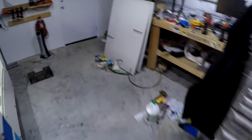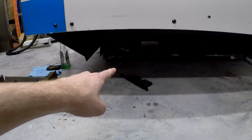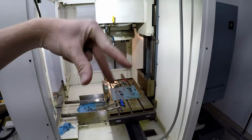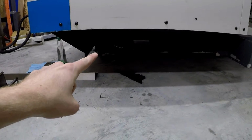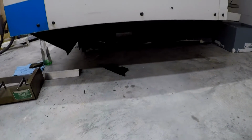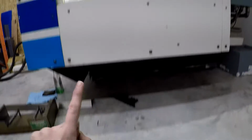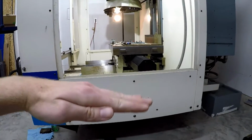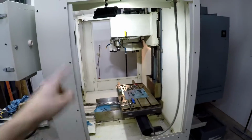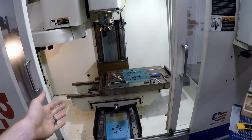Oh, one pro tip. I don't know if my wrench is still down here. When you're adjusting these guys, I found out if I loosen up one, because, you know, going back to engineering and planes, lines, and points, you only need 3 points to create a plane. So I would loosen one of these guys up and it would suddenly just start coming straight up. It'd be super loose to come up. Well, that's because the other 3 points were touching the ground and that one wasn't touching anything. So what I had to do is, when I loosened this guy up, I had to go over on the other side, loosen that guy up to try and level out this way. And then I'd go back and forth to level out this way once I got that straight. And I did that back and forth a couple of times to make sure everything was level. So we're straight, we're level, or at least we're level. I don't know if we're straight.